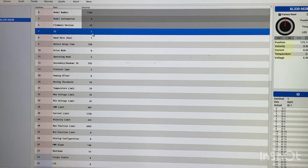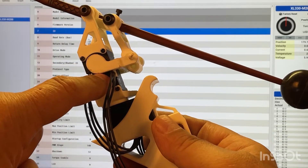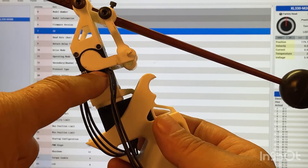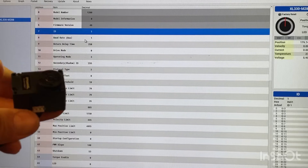The important field here is ID. This servo has an ID of 1, meaning whenever you send a command to servo 1, this is the one that responds — all others with different numbers will ignore it. On the Zenbot, I set the rotate servo as the main one, servo number 1, and the other servo on that robot as servo 11. The next robot would be servo 2 and servo 12, then 3 and 13, all the way up to 7 and 17.